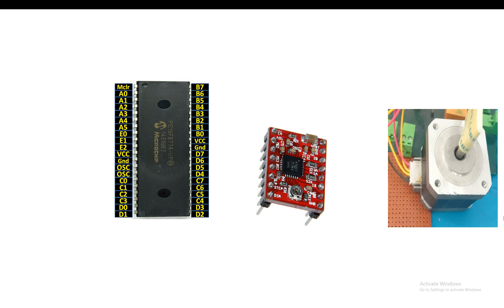If we hold the stepper motor with the connector on the left side, there are six pins total, but only four are connected and will be used. Let me show you how to label them: the topmost pin is 2B, leave it blank, second one is blank, third one is 2A, then 1A, then blank, and then 1B. So four pins are connected and two remain blank.